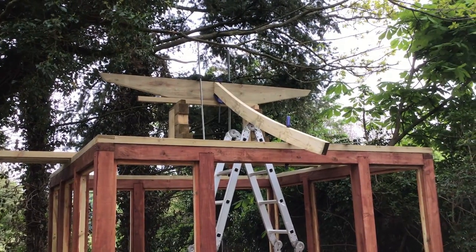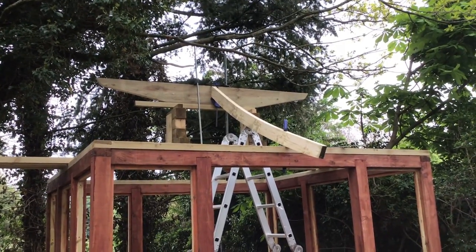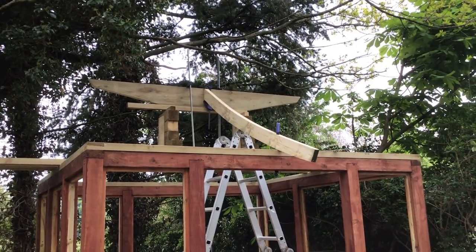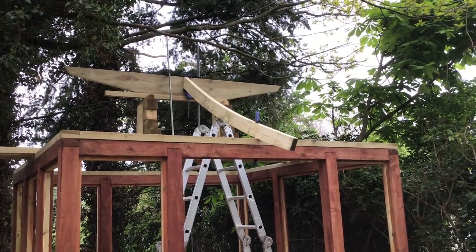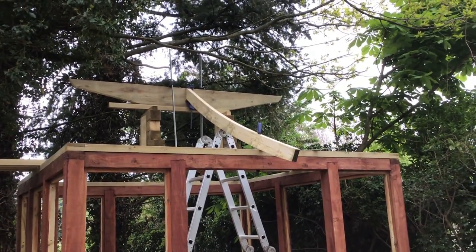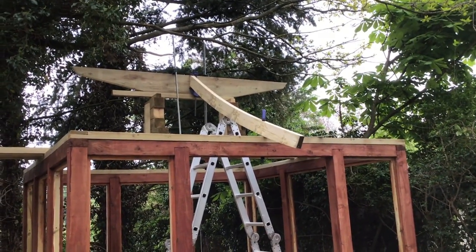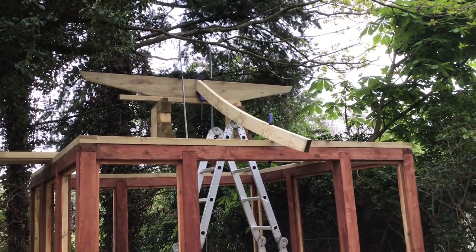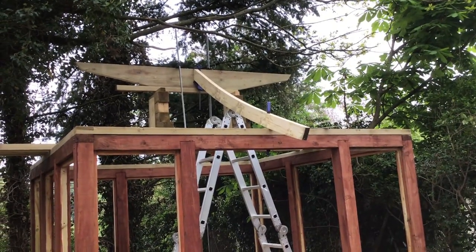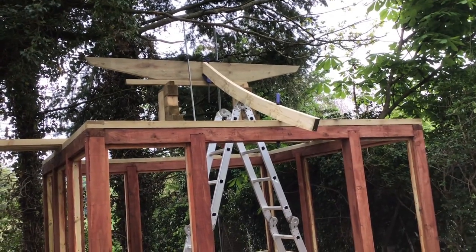I've offered the rafters up to the ridge, and to cut the angles correctly all I did was get a rule vertical to the ridge, drew a line and cut down it. Now where the overhang is on the top of the roof frame I'll mark that out again with a rule, looking at the angles, then cut it to shape. When I've cut the rafter at the edge of the house frame itself it will drop around about two and a half inches, leaving around two to two-and-a-half inches of the ridge visible on the outside.